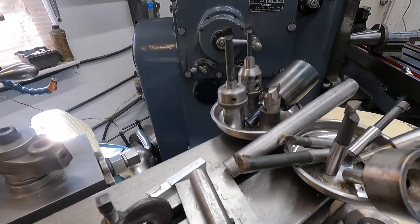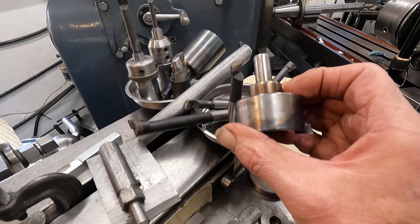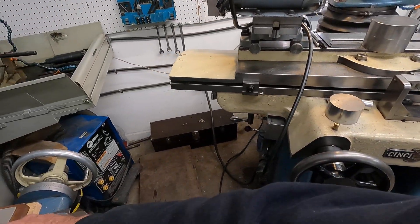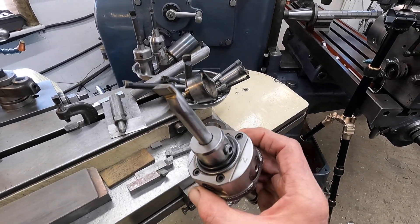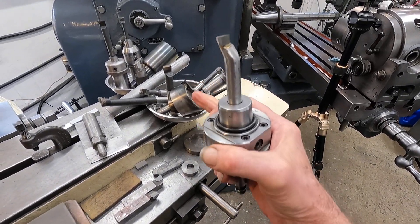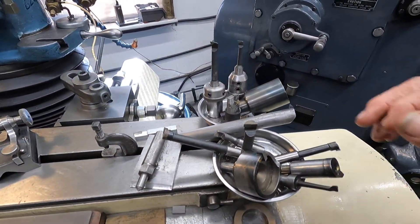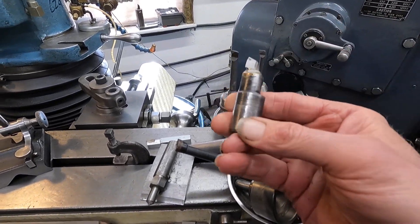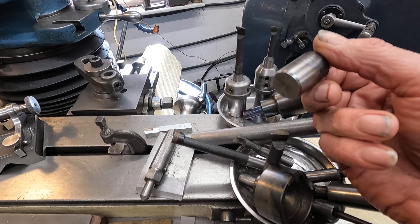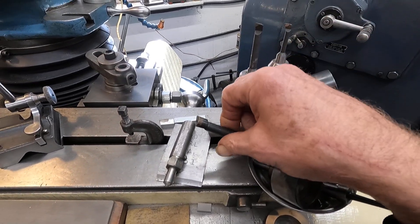Here's the collection of boring tools - a lot of them I've made. Ones like this look more like a fly cutter and it actually can be used as a fly cutter. It could be used in a boring head that has very little travel, so you make your boring tool larger. Here's a facing tool that could bore also - I made that out of a 7/8 inch hitch pin, just brazed carbide to it. Here's some commercial ones too.